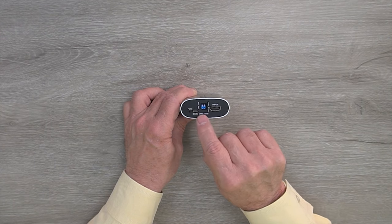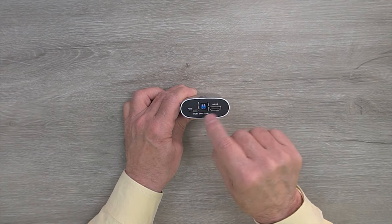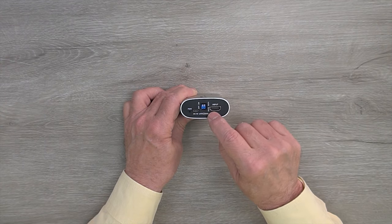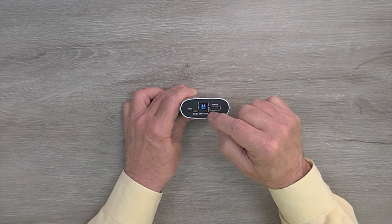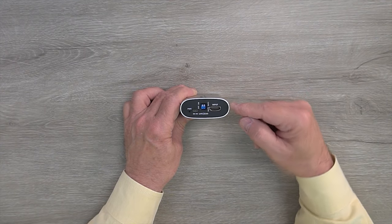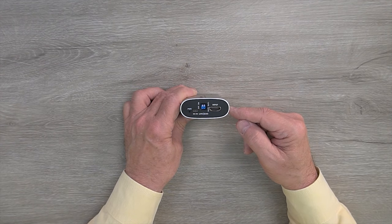To the right of that are two adjustment switches, EARC and EDID. The EARC allows you to accommodate a wide range of media devices, and you can choose between EARC or just standard ARC by flipping that switch. The right switch controls the EDID settings. You can either follow output number one or output number two for the synchronization of the monitor you're going to connect up to the product, and you can make that adjustment as needed for your media gear. These two adjustments allow this to accommodate a wide range of media products.